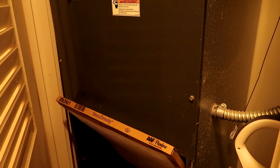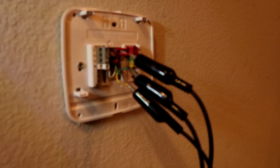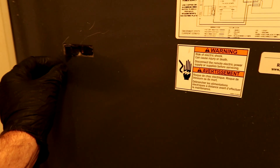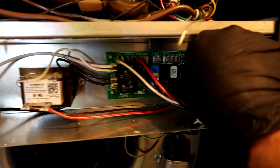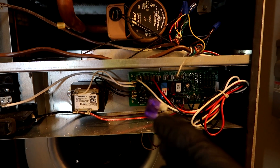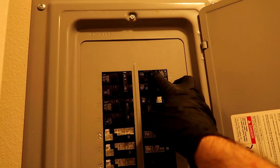Nothing. I'm wondering if the fuse popped — meaning bad contactor. I've got everything jumped out; it should be coming on. It came on immediately when I just had red and green, but since I threw the yellow in there it's not coming on. Let's take the cover off and check. Turn the breaker off first. The fuse is right here on the board — let's see if it popped. No, it's still good. Got a weird one here, an old head smasher for sure.